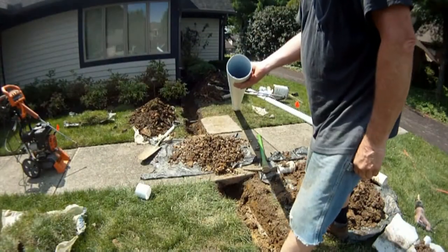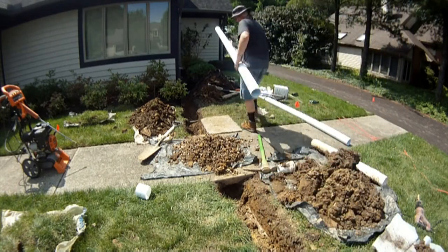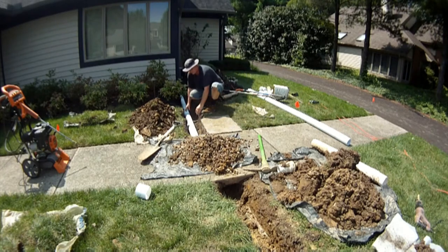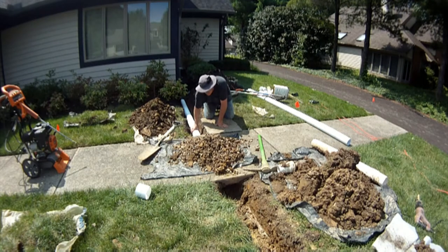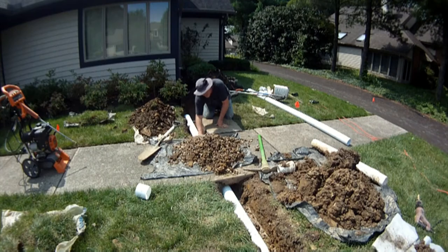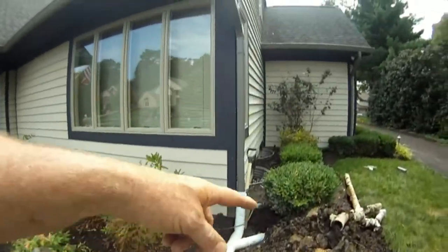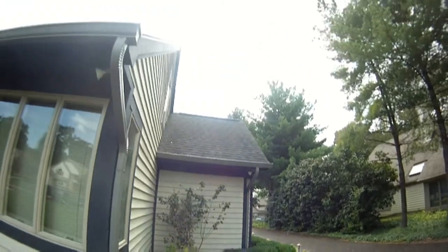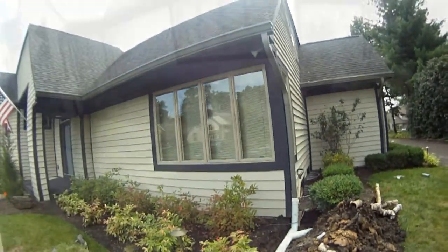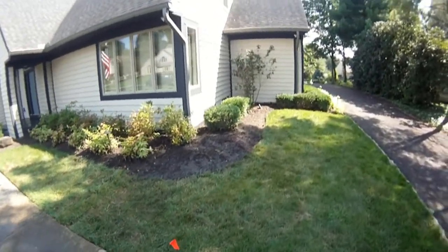Let's go ahead and continue with the installation. We're installing four-inch pipe, and if you've made a nice tunnel the pipe will go right through there. It's okay to give it some light kicks from the bell end if you have to, but if it's not going through you need to do a little more tunneling. This looks real good — nice tunnel, nice hookup up here at the downspout and the pipe coming in from the short roof. Subscribe for more how-to videos and thank you for watching.